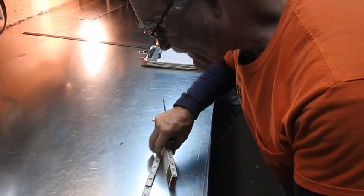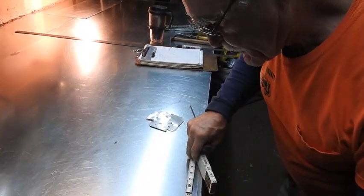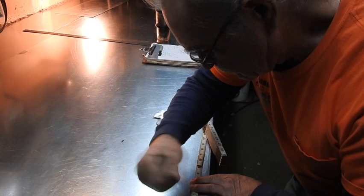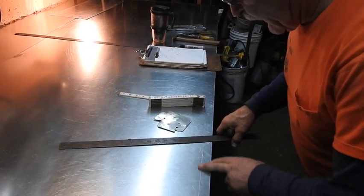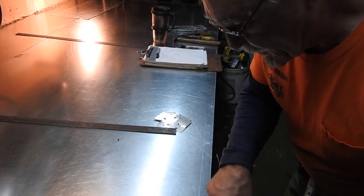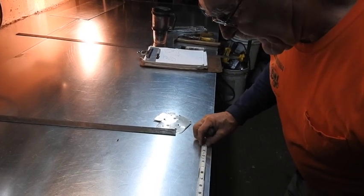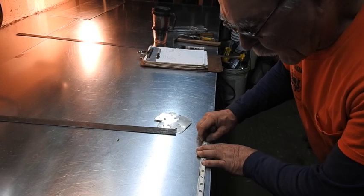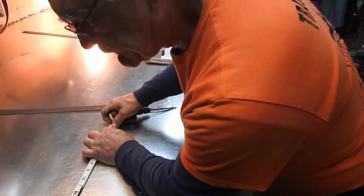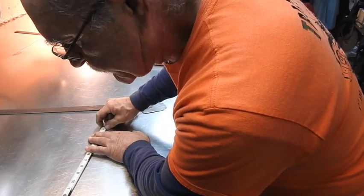So if that's the case, we've got 4-inch right here, there's 4-inch down here, 1/4 inch off of that. That's going to be our inside wrapper. It's going to increase to 10 inches down here, so I know off of this 1/4 inch line, which is the 4-inch mark, I'm going to add 10 inches to it, and we're going to add a 1/4 inch to that, which should give us 14 1/4 up here at the top, minus the 1/4.